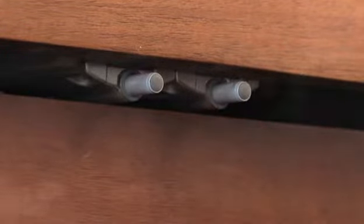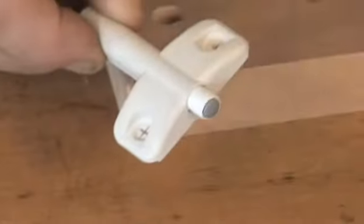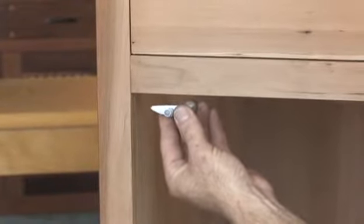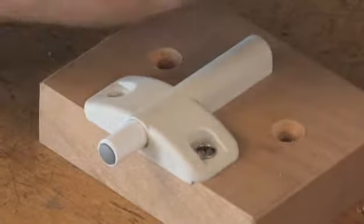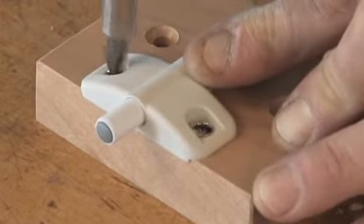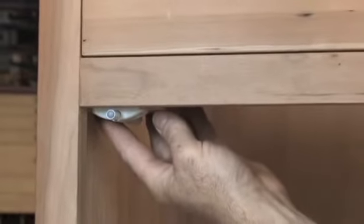One style of soft closer is available on cup hinges only, and it's incorporated into the hinge itself. Another variety is a separate piece of hardware that you install near the non-hinge side of the door, typically at the top. If you have an overhanging face frame, screw the closer to a block of wood. Size the block so its thickness equals the frame's overhang. Glue and screw the block to the case, making sure the face of the housing is flush with the back of the door. When the door is closed, the plastic piston retracts slowly until the door rests flush with the case.